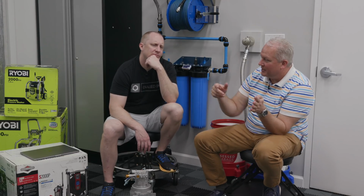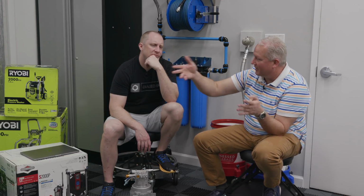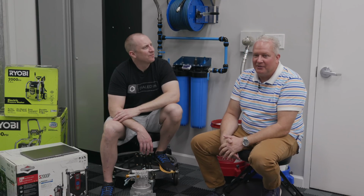So if you had a unit that had 2,000 psi and you were using a 25-foot 5mm hose and you went out 100 feet, there's going to be a difference. But if you lower the resistance by going to a larger hose 100 feet out, now you've made up the difference. So the PWMA, again, it was formed back in 1997.